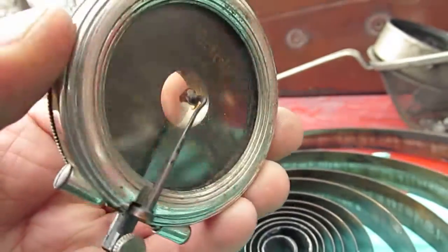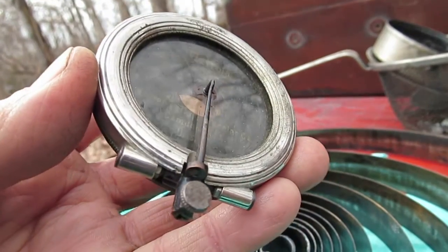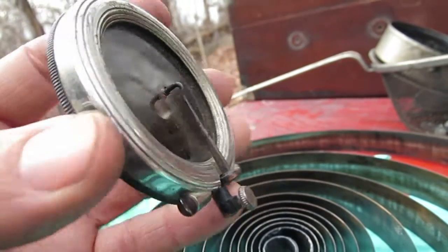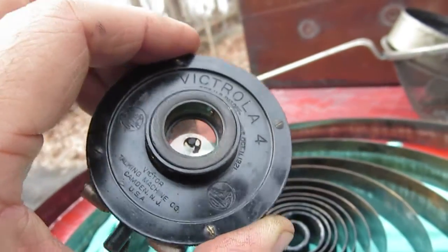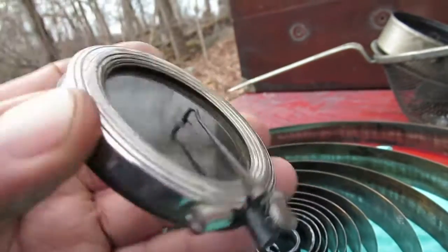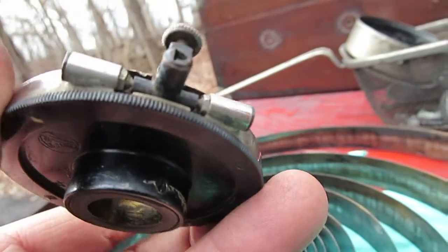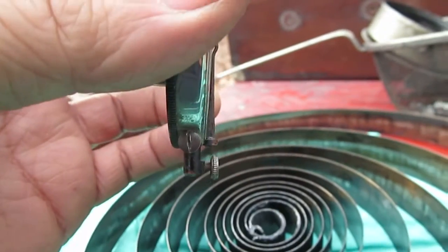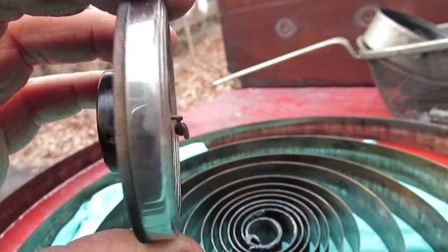This means the owner of this machine decided to upgrade very early on and lucked into an actual Victrola Number 4. When these trade, they're usually $200-$250 — I've seen them go quite high. This one will need rebuilding, which I'll do later: new gaskets, I'll replace this back gasket and the gaskets inside. The mica actually looks good — I'm probably not going to change the mica on this one because there's no cracks and it's not delaminating. I'll take it apart, clean all the little ball bearings out and re-oil everything. This one's pretty well aligned; I'll double-check that when I redo the gaskets.